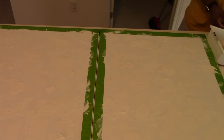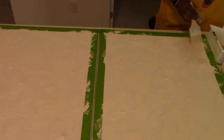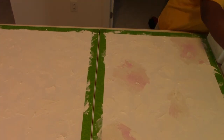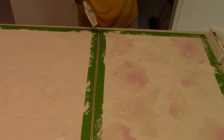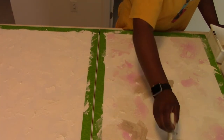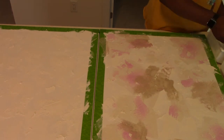I'm having everything set up, but this is where things got a little tricky. The spackle was pink-to-white, so when I put the milk paint on — since it's mixed with water — it turned the spackle pink. I was nervous. If I unmuted the actual footage y'all would hear me cussing because I was scared. But then I realized: if it turns pink when wet, it will obviously turn back to white when fully dry. So I just kept going.